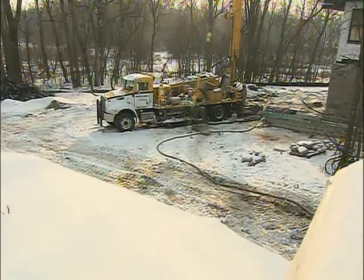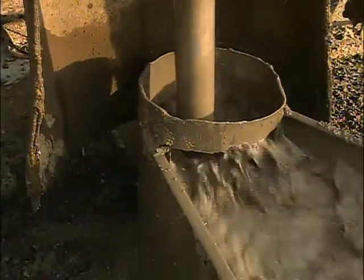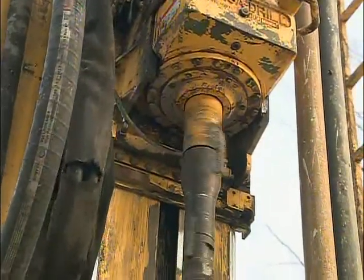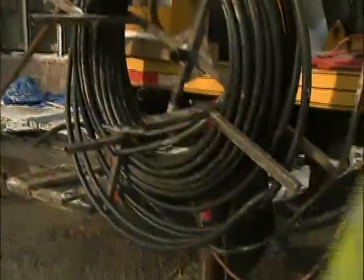David Henrich has been spearheading the operation here. It basically boils down to drilling a whole bunch of deep holes and setting some closed loops. The drilling process we're using on this particular site is mud rotary — we're using a fluid to lift the cuttings out of the hole as we're drilling through the sands and clays, making the boring that we're going to set the loop in. Once the holes are drilled, you're ready to put the pipe in.